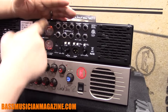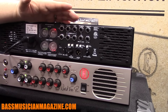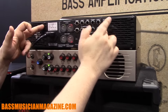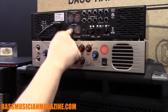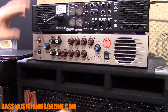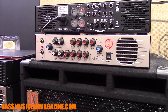You can cycle through the indicator — so this tells me I can put in all eight ohms, cycle through again and put in two four ohm cabs. It's a nice little reference. Because we have the two power amp sections, we can do a balance between the left and right, and we also have a crossover control if you wanted to use this as more of a bi-amped rig, so you can do different cabinet combinations. A lot of techs really dig that.